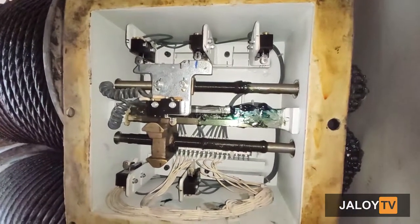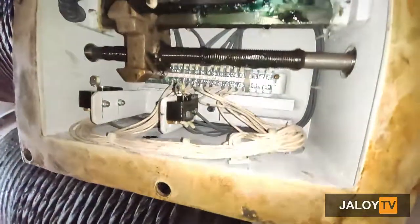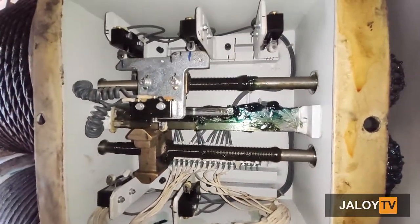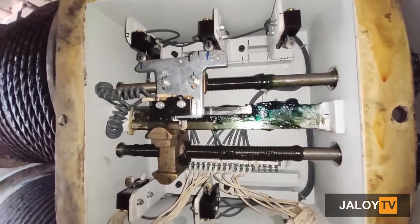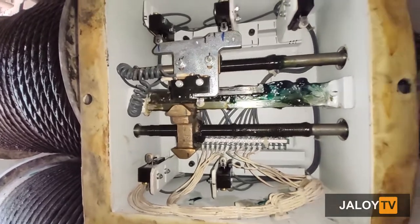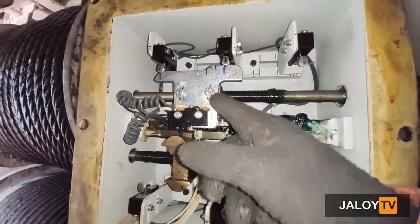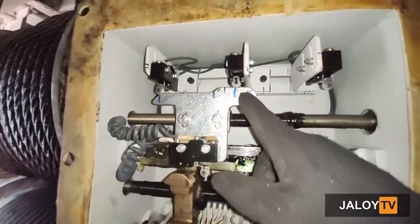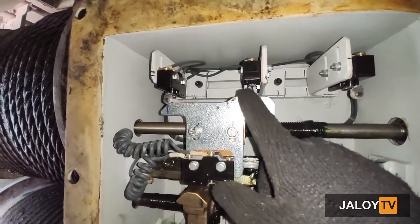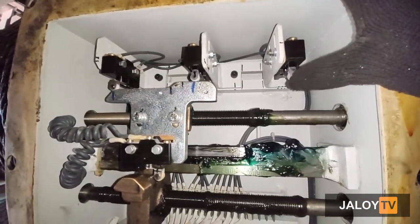These limit switches are used to restrict the winding and unwinding of the winches for hoisting and luffing, and to set the working range of lift and jib angle. The limit detecting devices are accommodated in the limit switch box in the machine room. The limit switch box is composed of two screw shafts on which each travel piece travels.